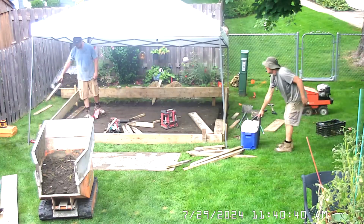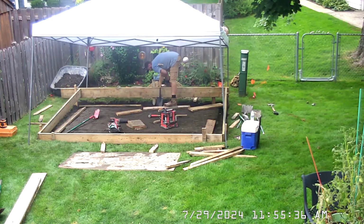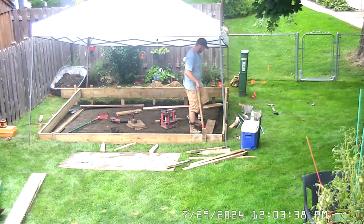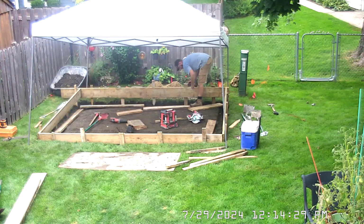The top of the slab is set at a minimum of 6 inches above the highest point in grade. This helps to avoid water getting into the shed and, in my case, ensure the door can swing fully open without hitting the ground. Once the top of the frame is level and square, it is staked in. Afterwards, the bottom of the frame is completed.